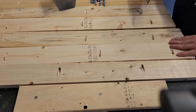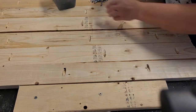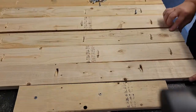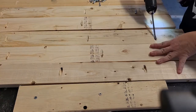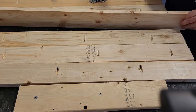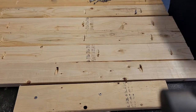I have a piece of wood on the end of the table that is screwed down, which helps me push against the boards as I'm screwing them in so they don't move around. Sometimes when you're doing pocket hole screws the boards tend to pop up a bit. You can use the clamp that the Kreg jig provides, or you can do what I'm doing — screwing a piece of wood down to the end of the table as a stop.